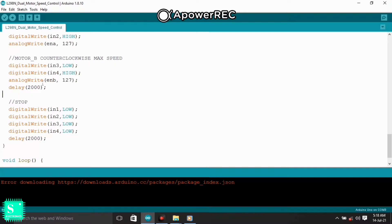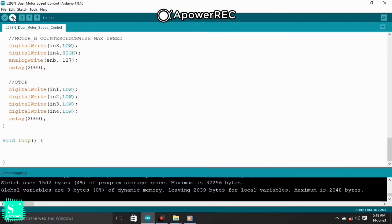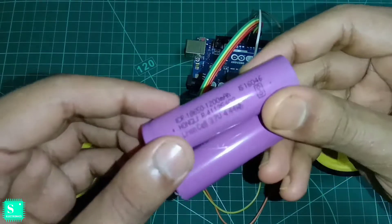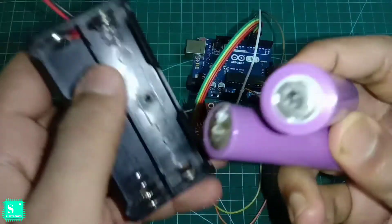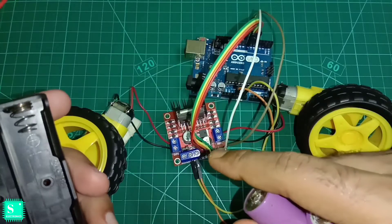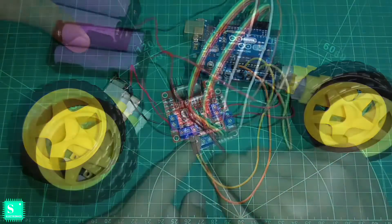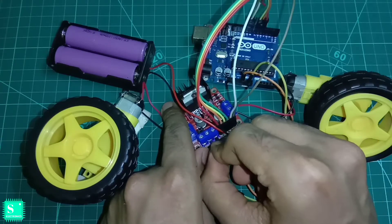Just upload the code to your Arduino — compile the sketch, then upload. We will use two 18650 lithium-ion batteries rated at 2000 milliampere-hours. The ampere rating should not exceed two amperes, which is 2000 milliamperes, because according to the L298N datasheet the maximum current it can handle is two amperes — above that it may get damaged. The VCC and ground of the L298N are connected to 5V and ground of the Arduino, powering the Arduino through the L298N.